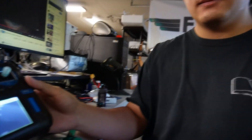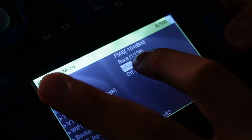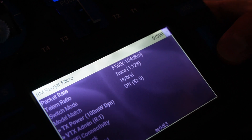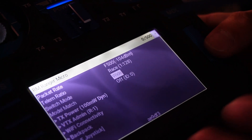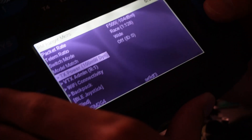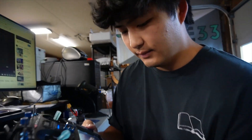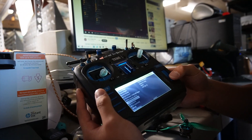When you're disarmed you get normal telemetry. I don't use the model match settings. Switch mode — either wide or hybrid, it really doesn't matter for racing. We just need a few switches for arm, turtle mode, VTX on a switch, stuff like that. I do use the VTX admin feature — it's very useful. When you power on your quad it goes right there, but you need telemetry to use VTX admin. It works on HD Zero too.